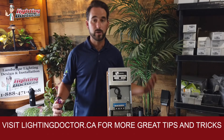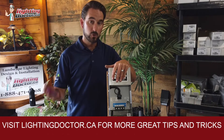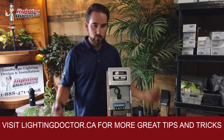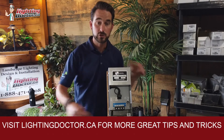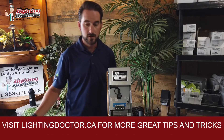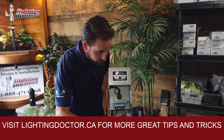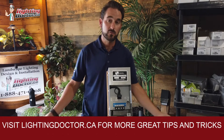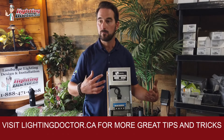Sometimes you'll get a system requiring 30 to 40 lights and you'll want to upgrade to something like a 300-watt transformer, which typically has multiple taps. On this one you can see two common taps, a 12-volt and a 15-volt tap. It works the same way — you can easily fit two to three runs going out in multiple directions from this transformer. For your longer runs of say 300 feet with more lights, use your common and your 15-volt tap. For shorter runs with fewer lights, wire those into your 12-volt and common tap. That's really the only difference between a multiple-tap transformer and a single-tap transformer.